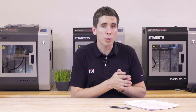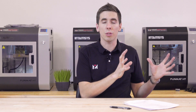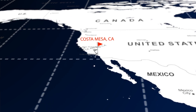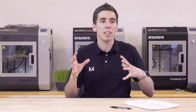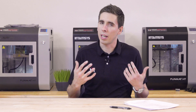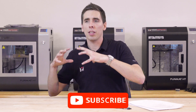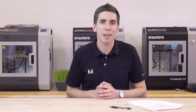Keep in mind that if you change your material, change temperatures, or move from a room with air conditioning to a garage in 80-degree Arizona weather, things will change and you'll need to retune. For example, we're right next to the ocean in Costa Mesa, California, where there's a lot of humidity, so we dry our filaments every single day before every print. Thanks for watching — subscribe and tune in for more videos on tuning, machines, the 3D printing process, and high-performance thermoplastics. Reach out if you have any questions!